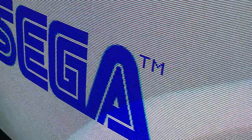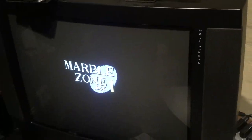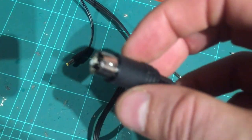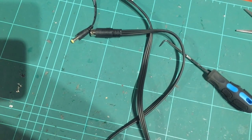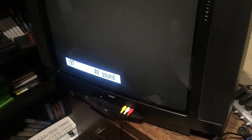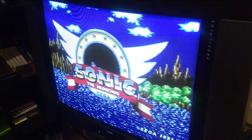It's naturally cycled and nothing went wrong at all. That tells me it could have been the cable - the old composite cable we had before. In RGB, which is how you should play these things, it's perfect. Coming back to the composite video cable, I'm suspicious it could actually be that cable. The RGB cable works perfectly, so let me grab another composite cable, plug it into the CRT TV and see what it does. Plugging in a different composite video cable into the front inputs - it doesn't look as good and I hate composite video.